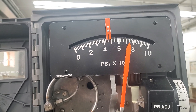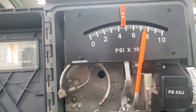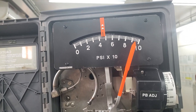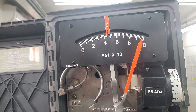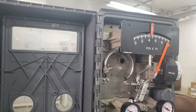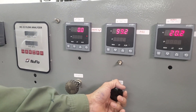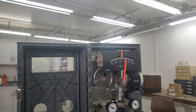I will increase to 75% — you can see it going up to 75 psi, which is 75% of the full scale. Then I take it to 100%. The indicator reads 99 — my instrument air doesn't quite reach 100, but that's close enough. This verifies that the process variable indication is working correctly.